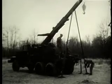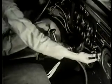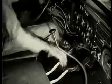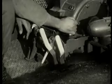To repeat, here again are the procedures necessary to operate the boom. Set the brakes using the foot pedals and micro brake lock switch. Shift transfer case to neutral and the transmission to 5th gear. Then engage the power divider. On the rear, open clutch air valve, engage pump, close air valve, and slowly open throttle.